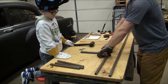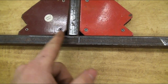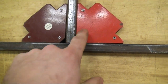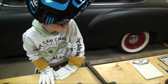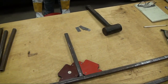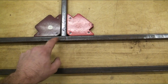So that's what it looks like up close. We have a mark right here, and we're going to do the top of our shelf at 18 inches for this one. You can see how these magnets give us a nice 90-degree angle — if we put the square on here, it would work the same way. The magnets will hold it in place while we put a weld on. We're going to get a little weld on this side and a weld on the other side, all the way up our marks on both pieces. When we're done welding, we're going to use the square to make sure it's square.